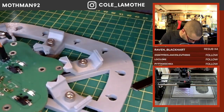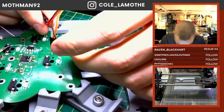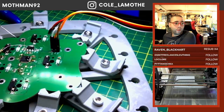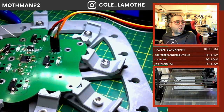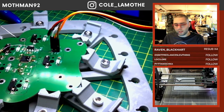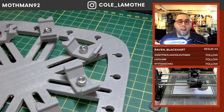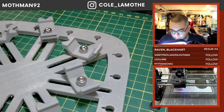It's just not going to play nice if I do that. I should probably check for that short before I go any further. The reset pin - there's some short there. The next likely candidate is that the chip itself is holding it under reset because of some error state.